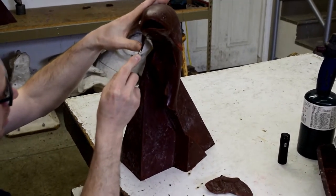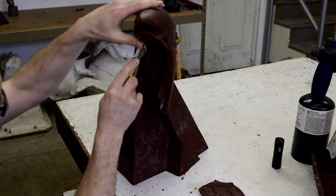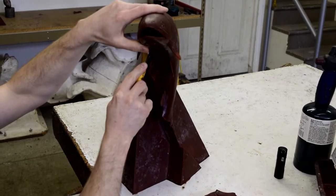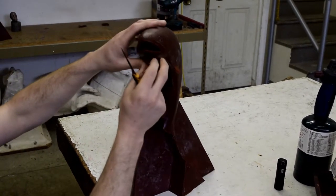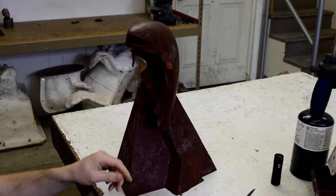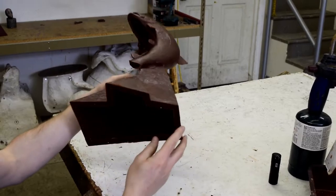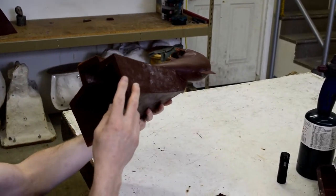The bubbles are filled with a paste wax, and the seam line is retooled with a variety of different tools that we use. Many of them are dental picks, or small knives, or tools that are very much like what the artist sculpted the original from in the first place.